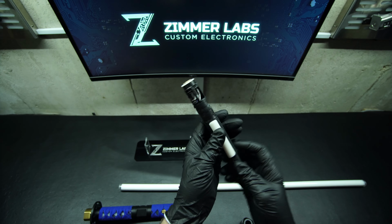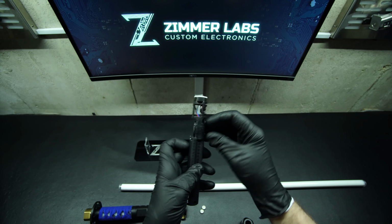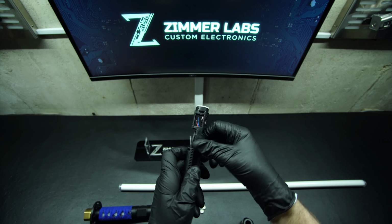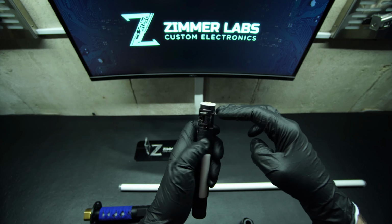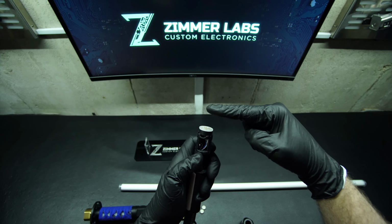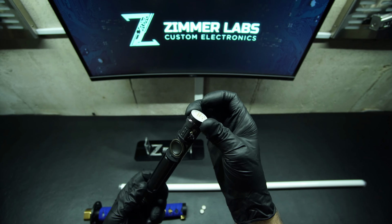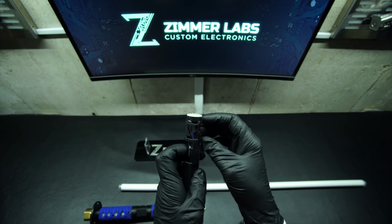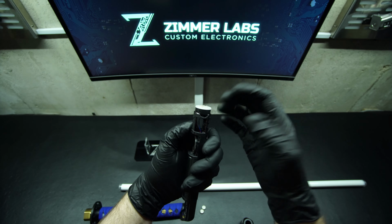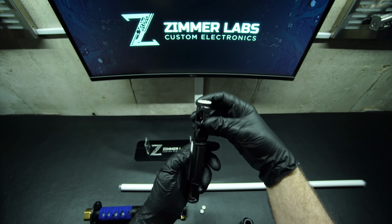And the only modification I had to make was to trim down this very top section, well, almost top section here. About 1.5 inches of it, I just had to basically sand it down, grind it down, and then repaint it. And then I cut off maybe 1 inch of the top of this chassis. It used to go up to about here. So I just cut it off and mounted this blade connector housing and blade connector to the top. Use some single stage epoxy to do that, and that dries like plastic but stronger. It's firmly affixed, it won't break off, it's essentially part of the chassis now.